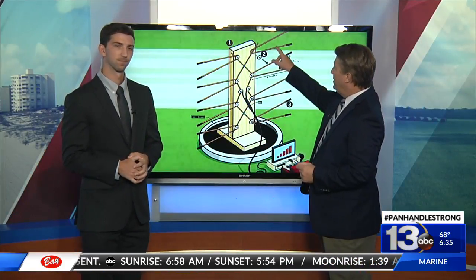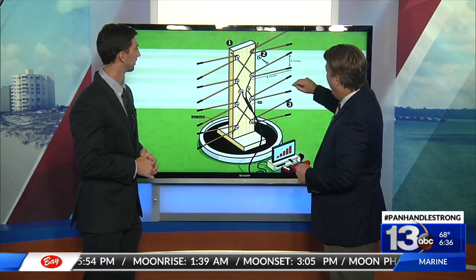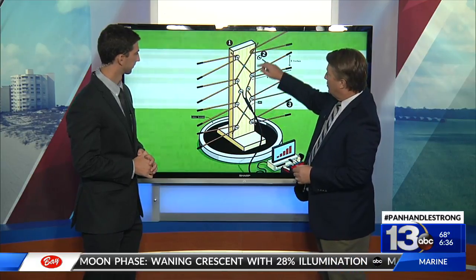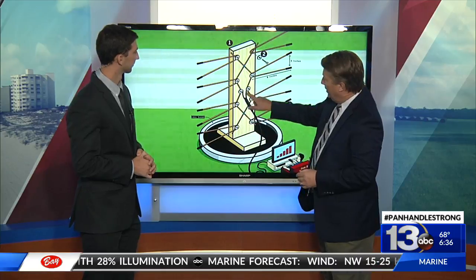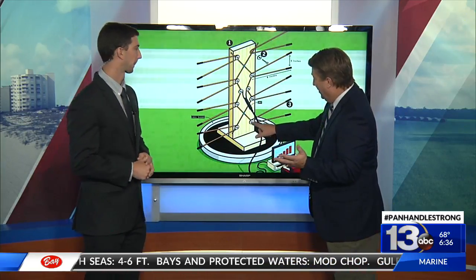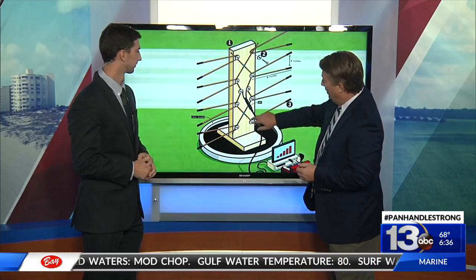The coupler is this little device right here. These pieces are the smaller 17-inch wires. The easiest thing to do is start at the bottom and put in all the screws first. There are seven and a half inches between the screws, and the two that hold the coupler go in the middle. It helps to have another person — my wife April helped — because you really need someone to hold the wires in place.